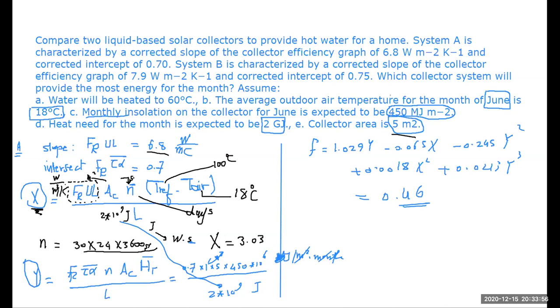So actually, a program like that, or just the analysis that we are doing, can provide us with technical feasibility, economic feasibility, as well as environmental feasibility, because the software can tell you how many kilograms or tons of carbon dioxide you are saving by using a certain percentage of your load given in solar energy. It can give this as tons of carbon dioxide, or maybe in number of barrels of unburned fuel, for example, saving 2,000 barrels of oil per year because of putting this number of solar collectors into a certain building or on top of a building.